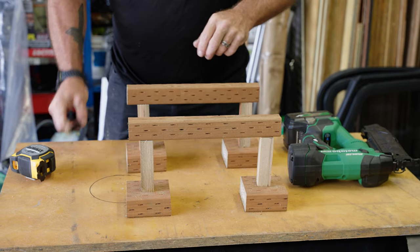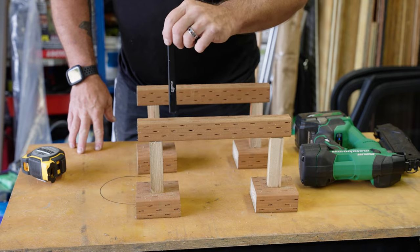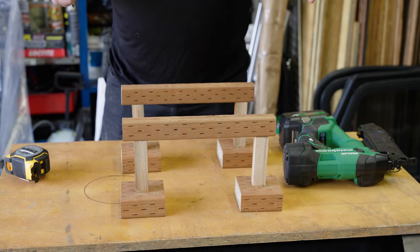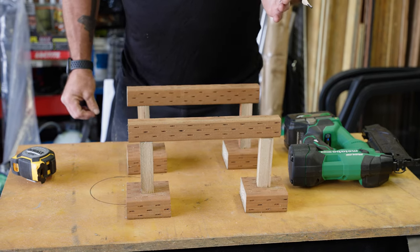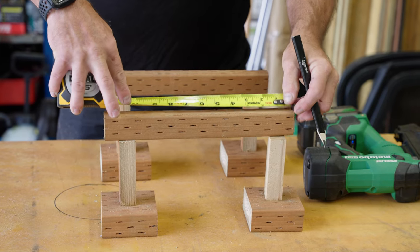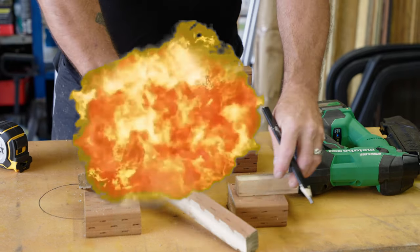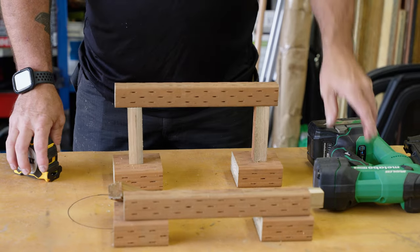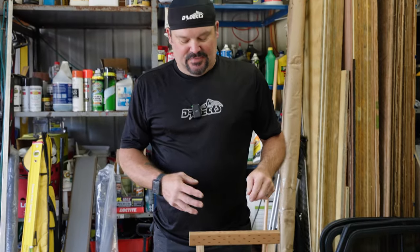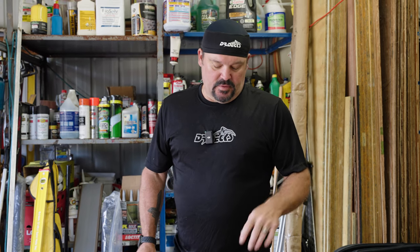So let's start making our joists. Since this is a replica of a six-by-six post and a six-by-twelve beam, we're going to put down maybe some two-by-eight or two-by-ten joists — let's do about a half inch. This is not going to be super to scale, but we'll just make some parts. I'm going to rip them down on the table saw, and I need 13 of them — we're representing one inch as one foot. So there are going to be 13 joists total, one every 12 inches. We'll keep things from collapsing because we're going to pin it all together with this Metabo HPT pinner — we have some inch-and-a-half 18-gauge brad nails. When I go to start nailing things together, it might get a little sketchy, but it's really just for fun.